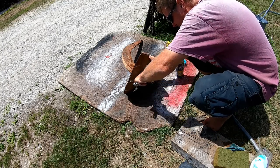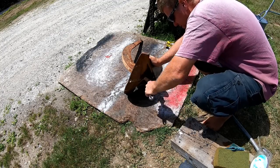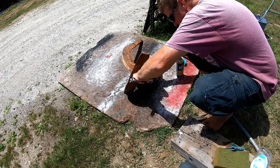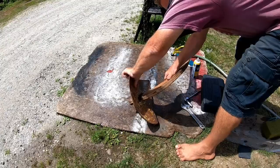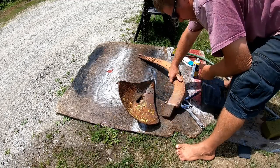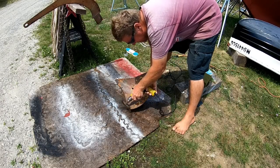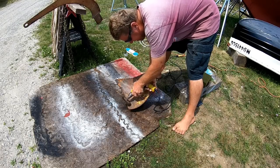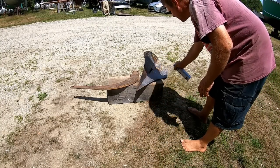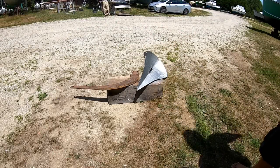That 44-pound galvanized spade anchor is the best anchor I've ever used or owned, period. However, like any other piece of galvanized steel on a boat, after a while the galvanized coating wears off and it begins to rust. So I'll go at it with a wire brush, try to get most of the rust off, and then spray paint it with Rust-Oleum, which is not going to last too long, but it'll keep the rust back for a little while.